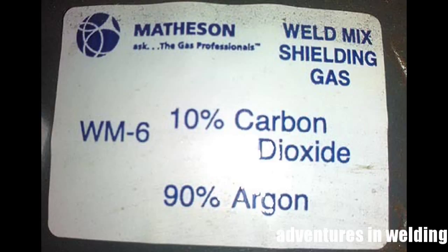This is one of the magic mixes: 90% argon, 10% carbon dioxide. Remember, you need at least 80% argon to achieve spray transfer, and it can be done with 100% argon, but you're going to lack penetration. So 90% argon / 10% CO2, or 98% argon / 2% oxygen — both of those gas mixes are suitable for spray transfer. The 90-10 you can also use for regular GMAW short circuit shielding. I've never tried the 98-2 for plain short circuit, so I can't say for that one.